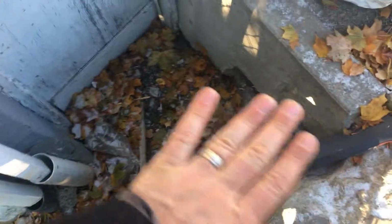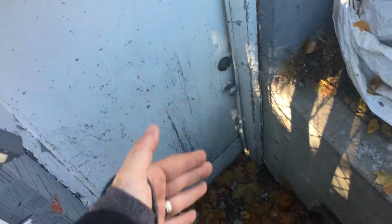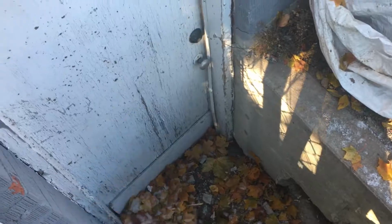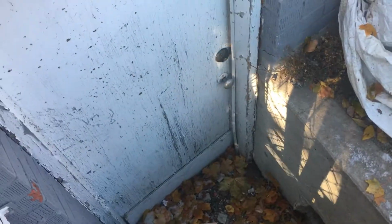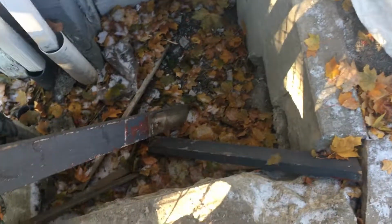I think at the very least, if we close this off with concrete and give it a good substantial slope away from the house, that'll help eliminate water wanting to work its way back in there, and we can make sure that it's parged and sealed up along the top of the concrete and up the wall. And when we put the corrugated aluminum on here, we can see if we can bring it right down and have it overlap that, so the water is going to hit the aluminum siding, run down, and immediately hit the slope, and not want to work its way into the crack or the seam where the concrete pad meets the wall. So I think that would be a good solution, whether in conjunction with or in replacement of the sump. I think putting concrete here is a better way to go as I'm standing here looking at it. But again, it's an option to consider.